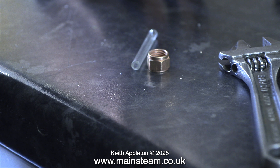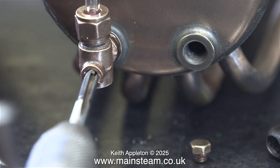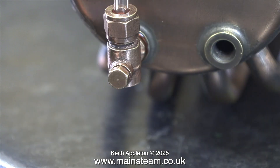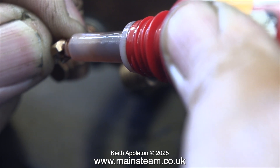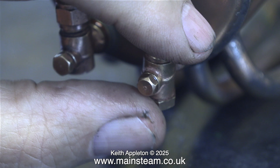Here's a short piece of glass tube and one of the nuts ready to fit to the water gauge. The hole for the inspection plug was not in very good condition, so I re-threaded it 3/16ths by 40 threads per inch, then fitted the inspection plug, once again using Loctite 542. This will fill all the gaps and seal it perfectly. I'm not using a washer — it's unnecessary, and besides, the overhang of the washer looks unsightly anyway.